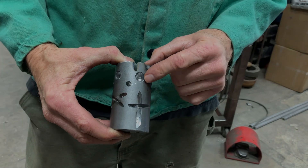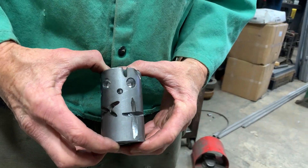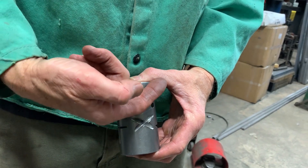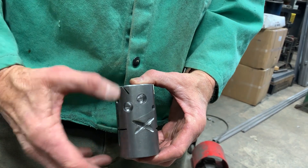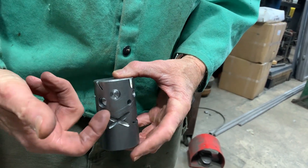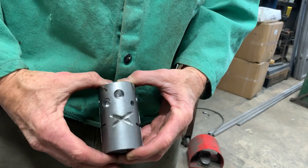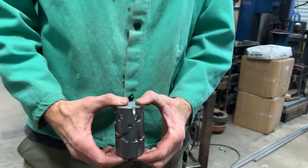What I've done to prep it is I've got half-inch holes and a three-eighths inch hole, but there's another more subtle thing: along 60-degree angles you have a shear couple — one part, the top part going right, the bottom part going left. It's a complementary shear couple, so you get a shearing action in this direction along the diagonal. Let's go ahead and heat this up, put it in the press, and see how it reacts.